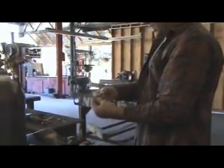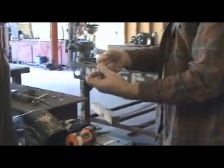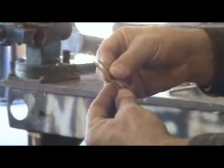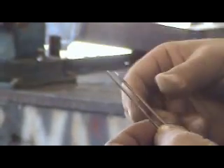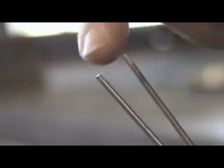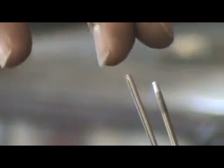So you can see, after a while, they tend to wear away. This is the new one and this is the old one. You just grind them down like that, and then you get a nice controlled flame off the end. You don't want to go any farther down than about two-thirds of that diameter — you want that little flat end on it to get that nice torch shape, that nice tip on the end when you're welding.